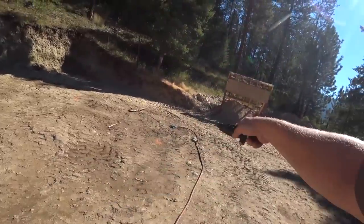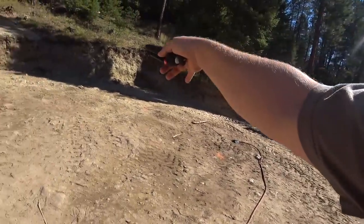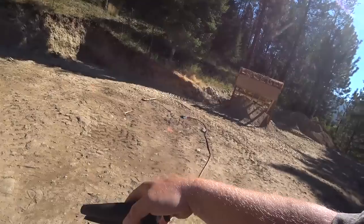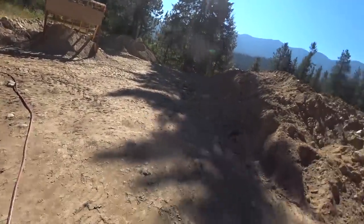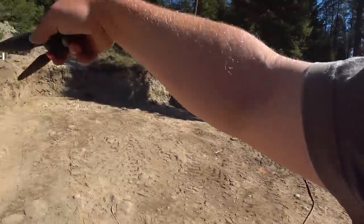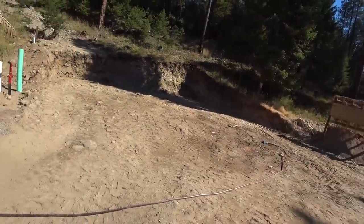This is something that for those folks who are watching this to get some information, you need to consider how your truck is going to get the concrete into your footings. For us, with a pump, the truck can sit right here or even over here and they can walk around and pump all those footings so we can build every single footing and pour them all at once.